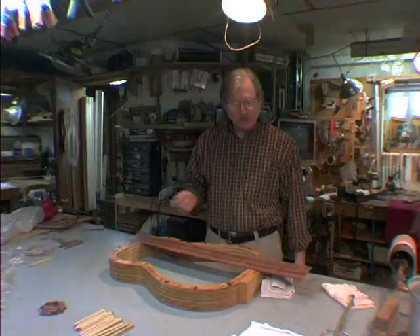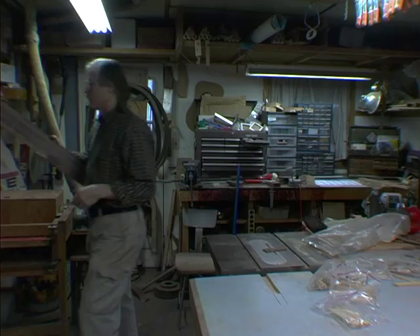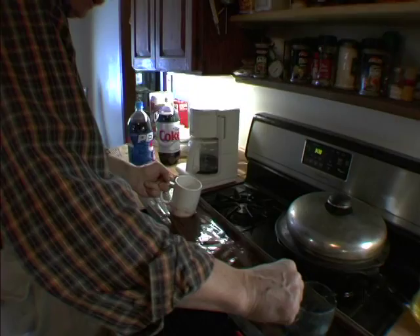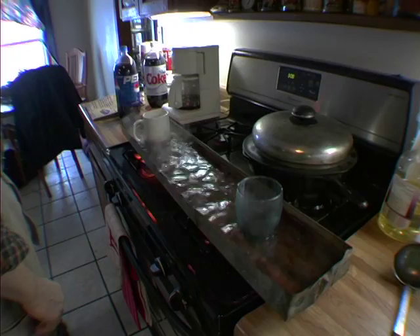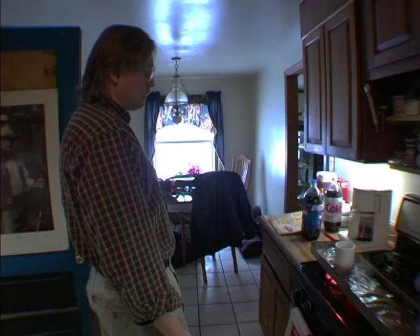Oh yeah, you can put it off as long as possible — just thinking about it sometimes, not to give you a headache. But I think we're ready to soak the wood, so we're going to stick it on the burner for a while. It's just a homemade boiling setup. I used to do this without soaking the wood, but I seem to have a whole lot more luck once the whole piece of wood is saturated with hot water. Rosewood takes a long time to dry out, so it takes a long time to get wet, so we're going to give this maybe eight minutes.